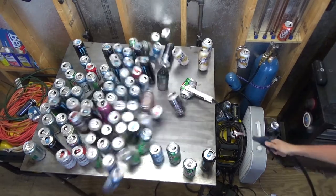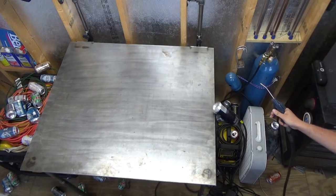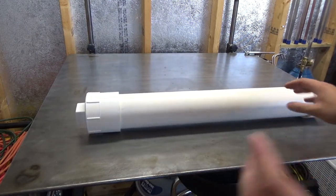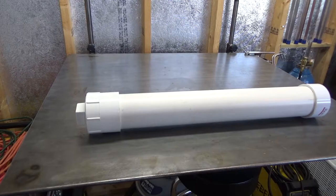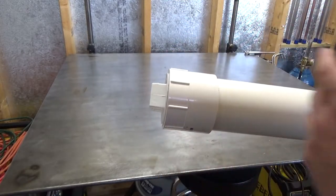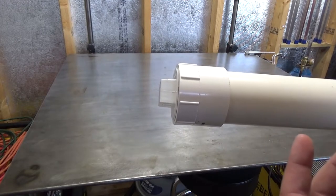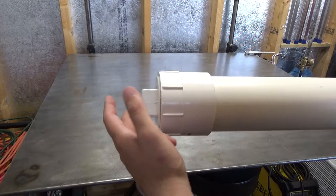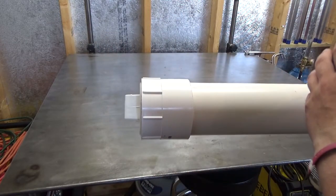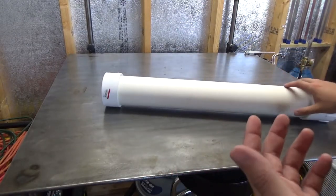The goal is to build basically a pneumatic piston — pneumatic actuator. I don't know what to actually call it; pneumatic piston sounds good to me. This would be a single-action piston, meaning the air only moves it in one direction. It doesn't move it in both directions like you typically see on a hydraulic cylinder. So we're only going to have one air inlet and outlet, and the return action is going to be springs that bring the piston back up in the cylinder once the pressure is released.